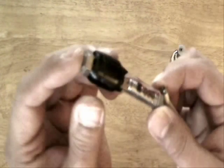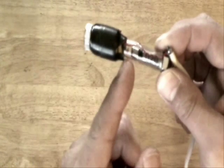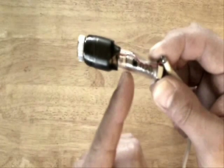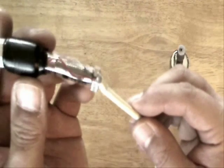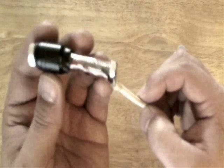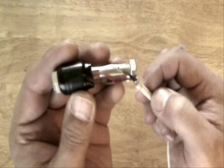So what I did was cut the tube at two and a quarter inches and grabbed a couple of stainless steel bolts. Now, you want to make sure that these two bolts inside — one on each end — do not connect or touch each other. One is for positive, one for negative. You get four wires on some USBs — the black and red are the ones you need. Red is positive, black is negative. The other two are data transfers — just cut those off.